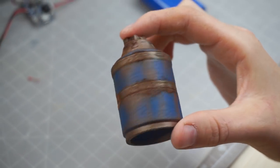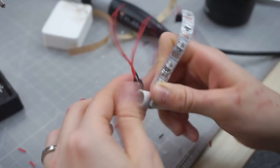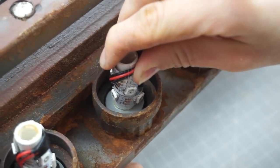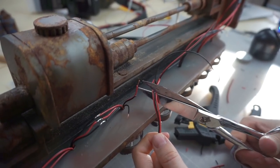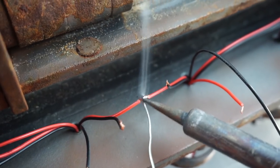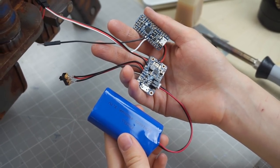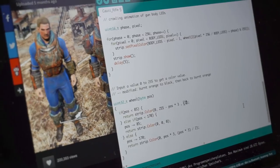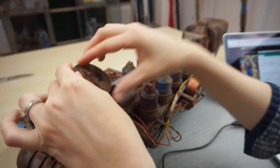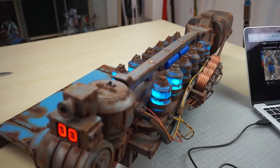We also added some more rust. I cut and soldered one meter of LED strip and attached the pieces to short PVC pipes. Those were then glued and wired directly on the rifle. The wires at the bottom stayed visible, but they fit very nicely to the rest of the gun. The final wiring was controlled and powered by an Adafruit trinket and a power boost. For the animation I edited the code of the Adafruit NeoPixel library. To hide the whole circuit I simply squished everything into the hollow part of the barrel.